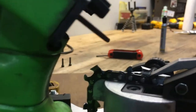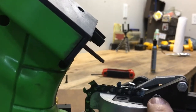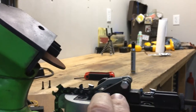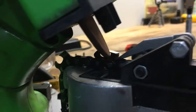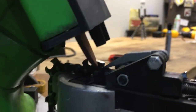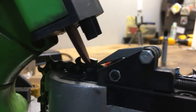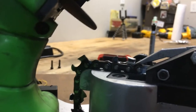When you set up a chain, you put it in the little vise here. There are adjustment knobs on the back — this adjustment knob shoves the wheel forward or backward. You adjust it so that when you bring down the moving wheel, it just cleans up that front surface, the leading edge of the tooth. You shouldn't see any daylight in there — that's about right. Then you go around and do that whole side of the chain, all the teeth on that side.